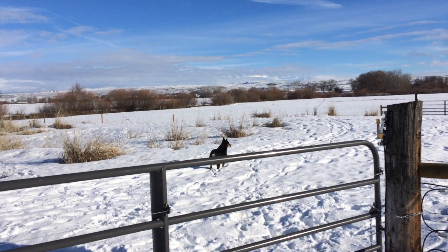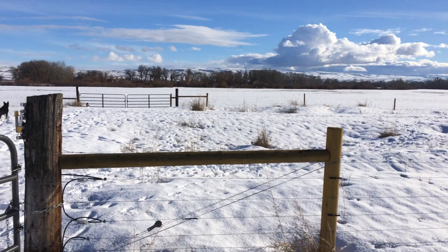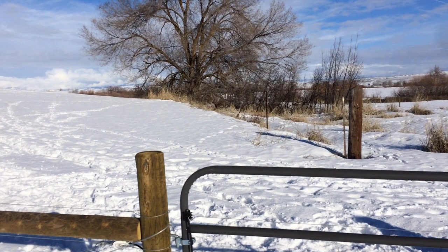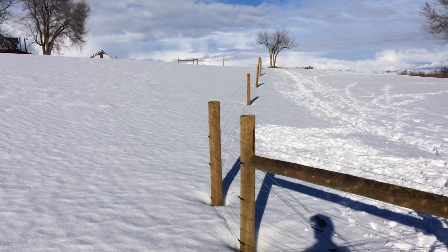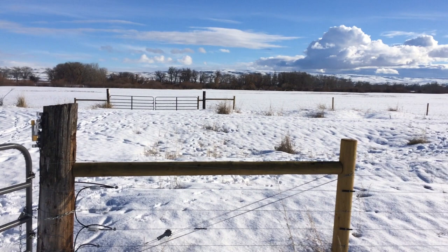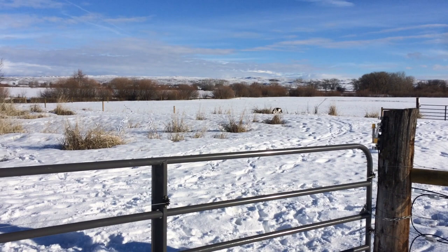I think I ordered about 500 posts to do this — we had leftovers because we changed where we fenced from the original design. There would have been a lot of concrete if we'd concreted them in, plus it makes it a real pain to pull out later. Concrete usually just fills an auger hole but you still have dirt all around it, so it doesn't actually make the post that much more stable — it can still move with soft ground. We decided to go with the post pounding option: a lot less labor, cheaper, and when it was going good we could pound a lot of posts in a day. Alright, hopefully this was a good informative video — let us know if you have any other questions.